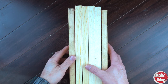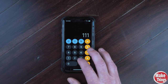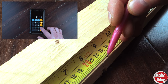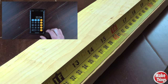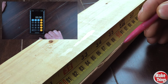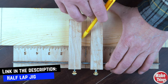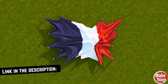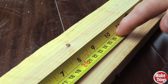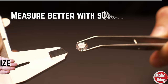I have a box I'm building for overhead track lighting that's 43 and 3/4 inches in length. I'll convert it to 111.2 centimeters. To divide it, I'll take the number of cross members and subtract one — I have six pieces here, so I'll divide by five. Dividing my length by five gives me 22.2 centimeters for my center joints. Once I've made my first mark, I'll add 22.2 to my first number, hit the plus button again, and add the next mark all the way down. I'm not fully conceding to France, but I have to admit this is the easiest way to create frames, and a lot of tape measures already have metric on the opposite side.